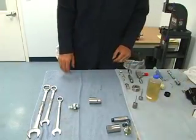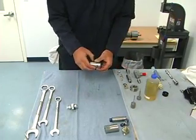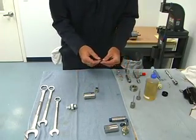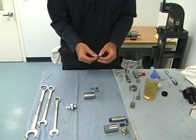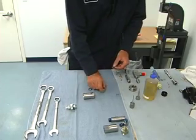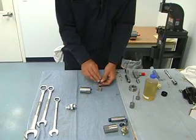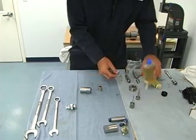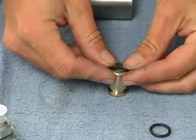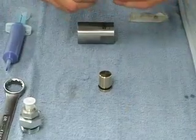We're going to get on the assembly here of the hydraulic auto bleed down. We start off with the hydraulic portion of the valve and get the piston and the O-rings for the piston. One of them is flat and is cupped on one side for the O-ring to sit in. So with the piston facing on the table with the groove down, we want the cupped part of the O-ring looking up at us. We'll get some hydraulic oil on there and slide it down over the piston, making sure that the cup is still looking up at us after we roll it on.